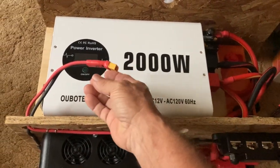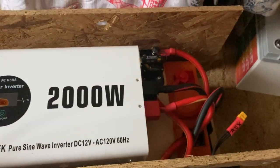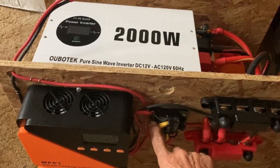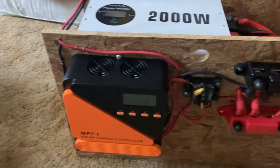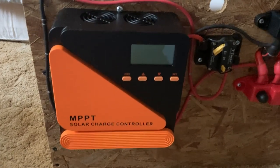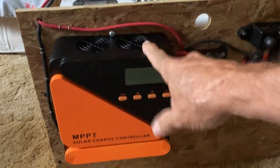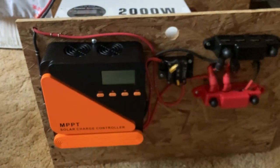Got the PV - this is for the solar hookups from where I run a hole in the chuck wagon box. Comes down, got a 60-amp breaker - twice the current. I'm just using it pretty much as a cutoff switch with a little bit of protection, but mainly a cutoff switch. Down to my iSunergy 30-amp MPPT. I'm starting to really like this thing a lot - it just works, it's simple, no frills, gets the job done, plenty of airflow.